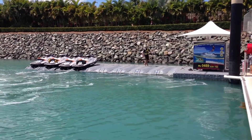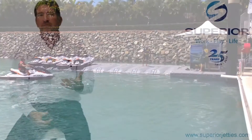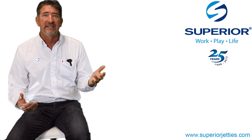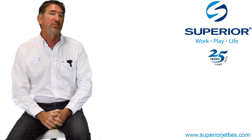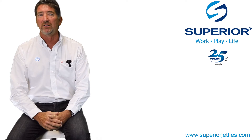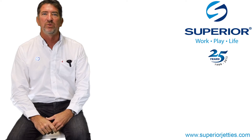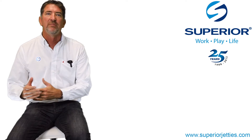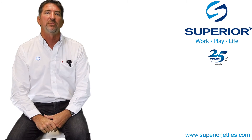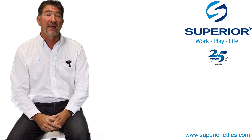We've worked closely with rental businesses that use their jet ski docks over and over, whereby a private dock might be used once a week. These are often used three, four, five, six times a day as that ski is brought back from a rental. These are the people we talked to about the design. We actually removed rollers because we found that the roller was impacting in the same place on the hull each time that ski came in, which is not actually good for the ski. By having a flat ski dock and polyethylene which is quite slippery, they're able to spread that load and not have any detrimental impact on the ski itself.